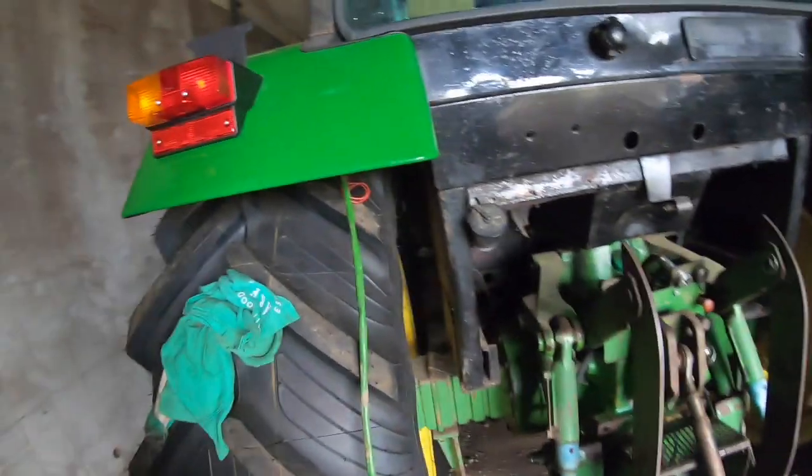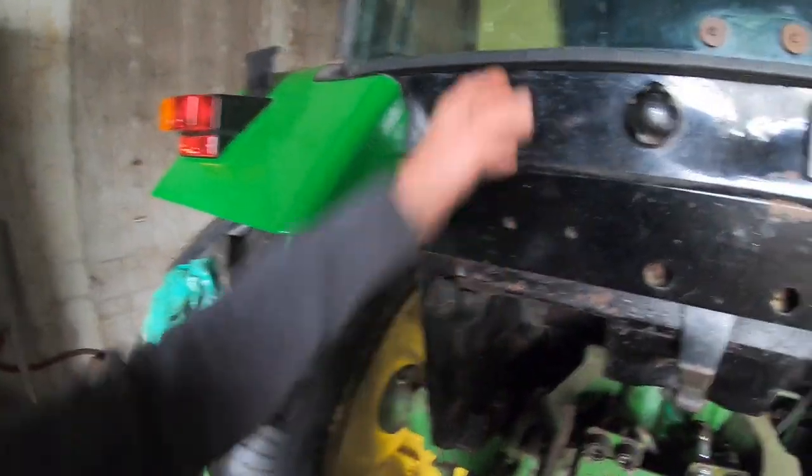He had problems in here. There's a little plug here, and there were problems with it. It was all corroded inside and wasn't actually making any contact. We cleaned all that, copper greased it up, and it's working now. So hopefully it'll stay working. It's a genuine plug, so I just like to leave it alone. He had to do a lot of wiring inside.